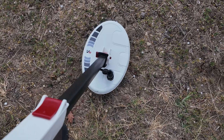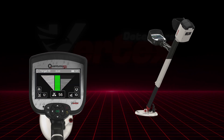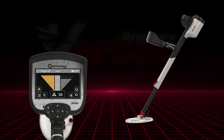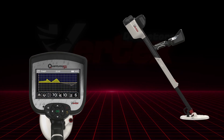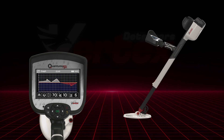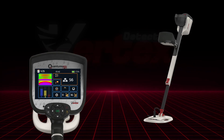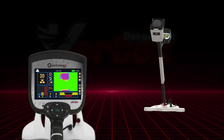And last but not least, with the V10 coil, a simple interface shows: green in the center for general metal presence, red to the right for common metals, and yellow to the left for high-value targets. The graph shows yellow spikes above the line for non-ferrous metals like gold or silver, and red dips below for ferrous targets like iron. This intuitive color system, customized for each coil and detection mode, helps you assess targets instantly and dig smarter every time.